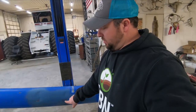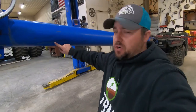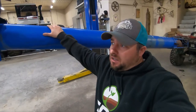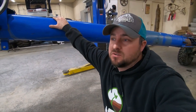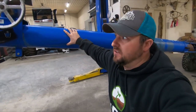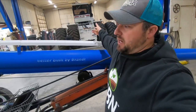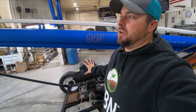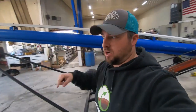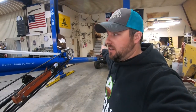Now that I have the auger in, I noticed there's a hole here that I need to patch and fix. The other problem is there's a crease right here in the side of the auger. I've got to pull the flighting out to fix this — the flighting inside is nylon, which we replaced a few years back for peas so it's easier on it. I can't weld on it or heat it until I fix that. I'm also going to flip this gearbox 180 degrees so the belt is on the other side, and I want all the controls and the motor to be on one side.